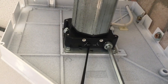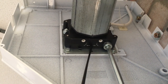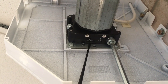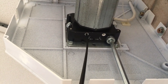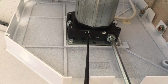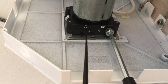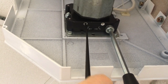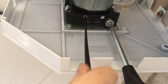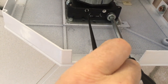That is the direction of the motor, the direction of the axle, which way it's going to turn, and it's relevant to this particular pot. As you can see, on the inner side, there is a small plus or minus, and what we need to do is insert the wand and turn to the plus. Once we turn to the plus, we keep our finger on the test lead and gradually inch the axle forward. In this instance, we need to add on another 2 turns. We already have 4 turns on, that's 5, and that is 6.